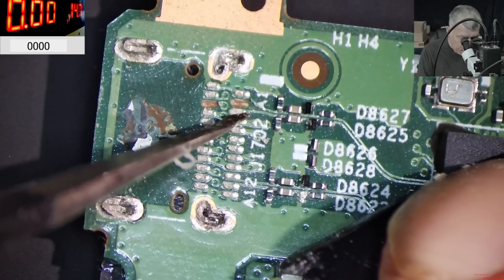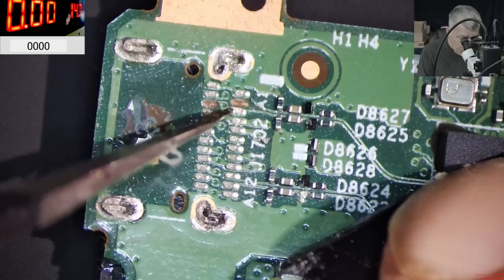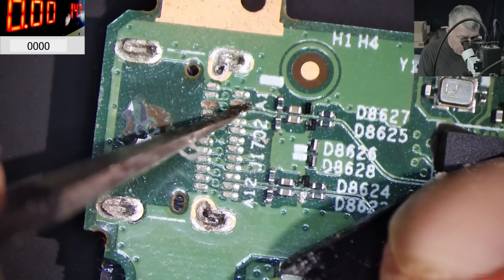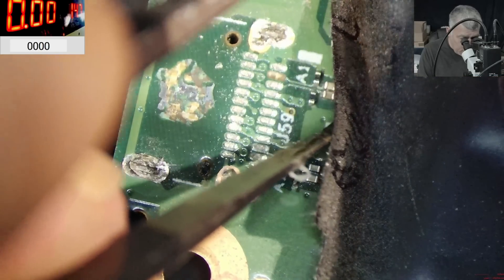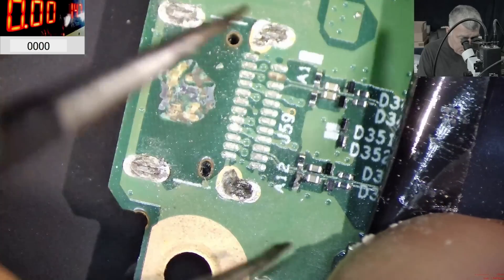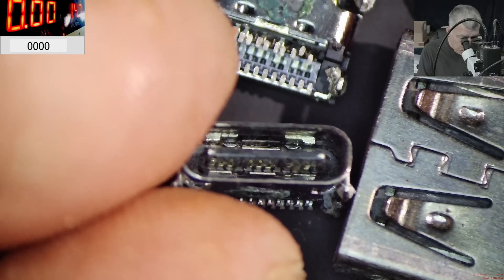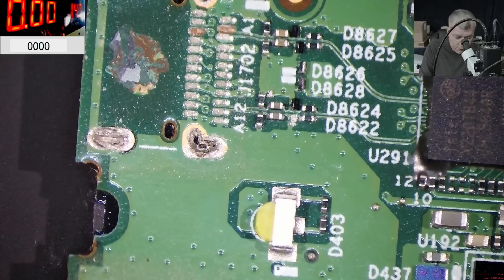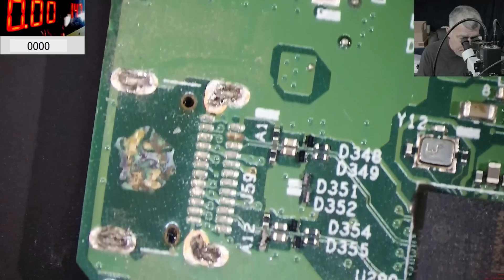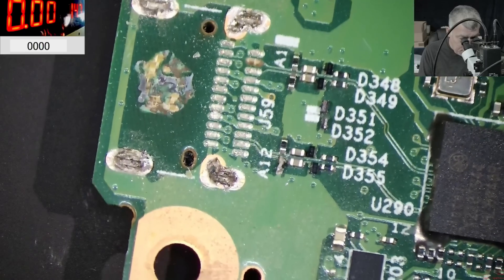This pad is still fine, but this one is gone — we can fix it. And this one is gone, which we can also fix. Here we have only one pad which is gone. Now, the ports themselves: this one is looking good, I can't see any issue with it. And this one is looking good. So I'm not going to replace the ports. I'm curious what decision you'd take on a case like this. Replacing the port with a brand new one will not help — the ports are fine, the issue is the traces.